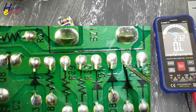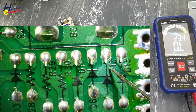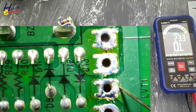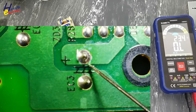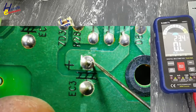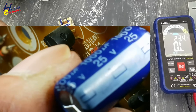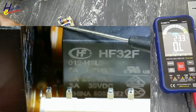These two points are output terminals. This diode and this diode are coming to this point and this one. That means this is the positive terminal — this is the common side, cathode-cathode — so this is the positive terminal.